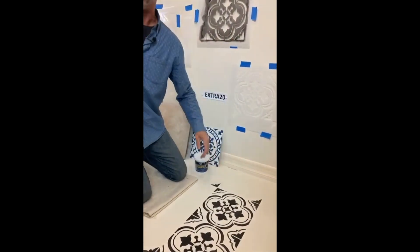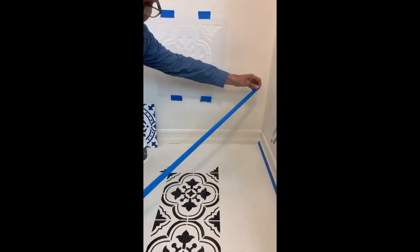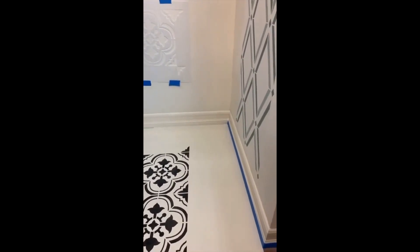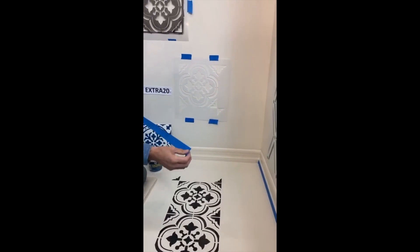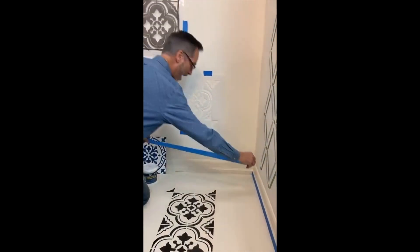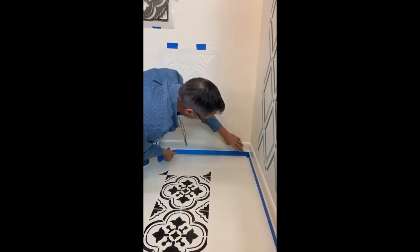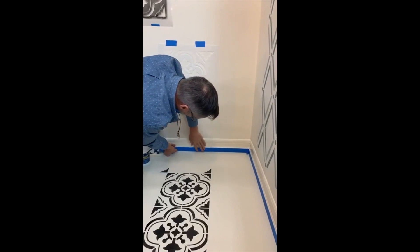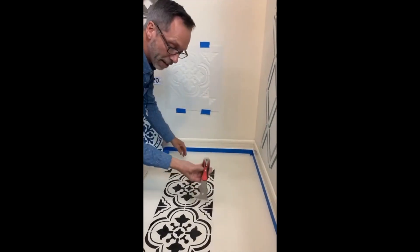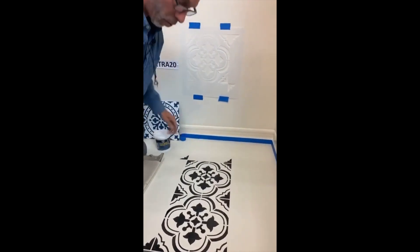I'm going to mask this first. This is our blue painter's tape. I like to keep my tape as long as possible when I'm masking — I'll mask the whole baseboard with one piece without ripping the tape. That way when I'm removing the tape, I just grab one piece and remove it, as opposed to having five pieces that I have to get down and remove each time. I'm going to place this here, then take a 5-in-1 tool and get my corner nice. And we're masked out.